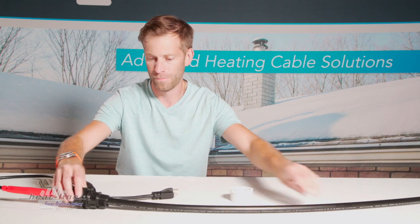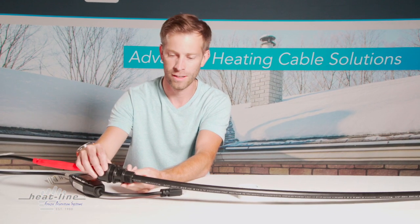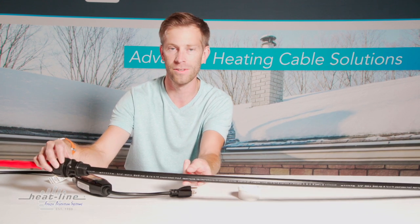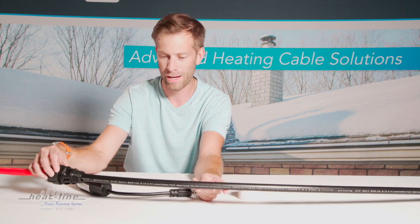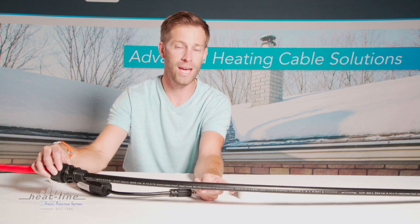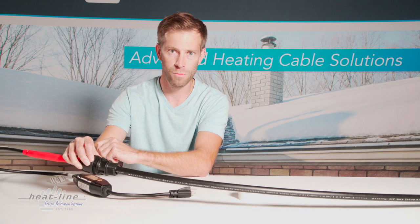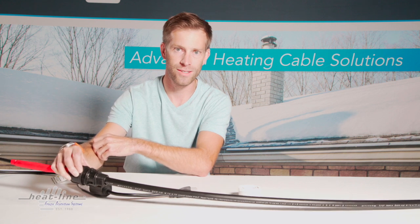The RetroFM features a one-inch male thread connection. A lot of people may ask why a one-inch thread when this product is kind of intended to be used in a pipe as large as two inches. The RetroFM can be used in pipes ranging from inch and a half, literally right up into a six-inch pipe range. We are outfitted with a one-inch male thread, but we can always increase the thread size.